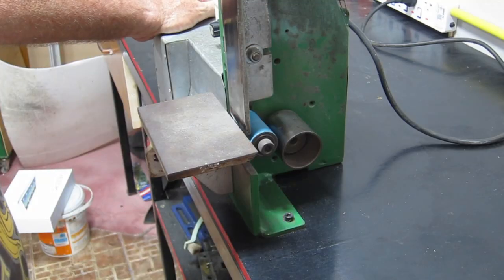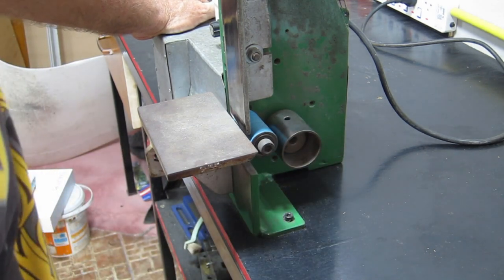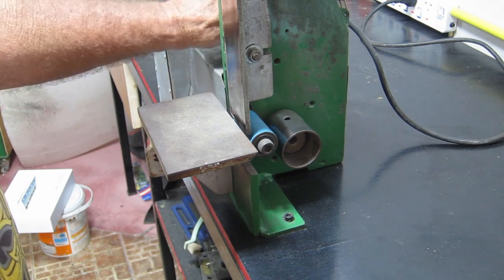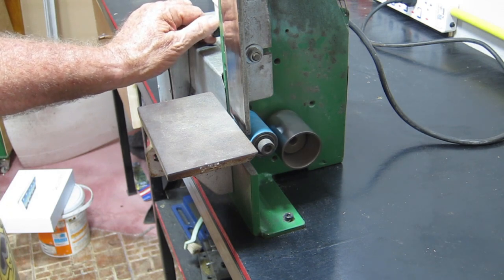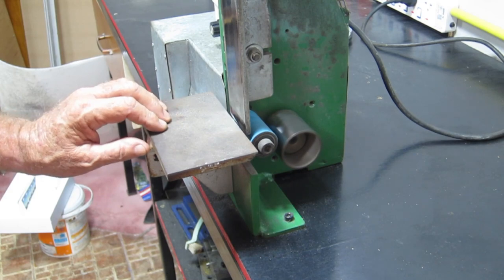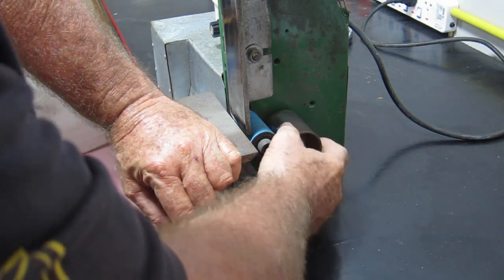Follow me over here to the belt sander and I'll show you what the problem is. I actually built this back before I'd finished building the lathe. This drum here was made by welding a few bits together and drilling holes in it in the drill press. When you fire it up and crank it to get it running fast enough, it shakes the hell out of it. So what I'm going to do is cast an aluminium version and machine it up.